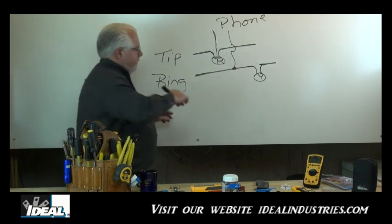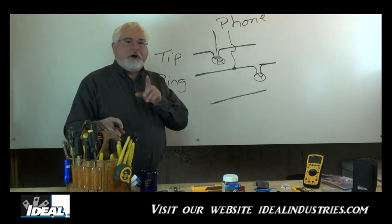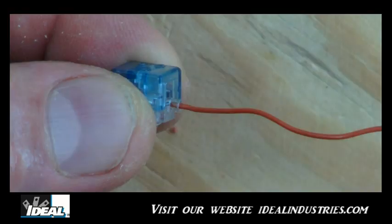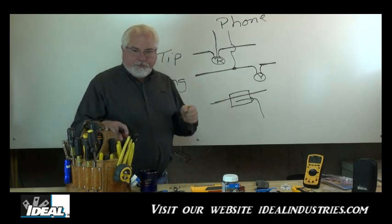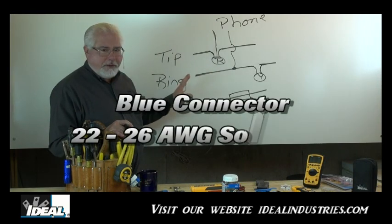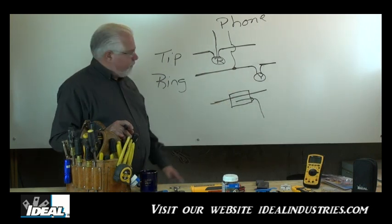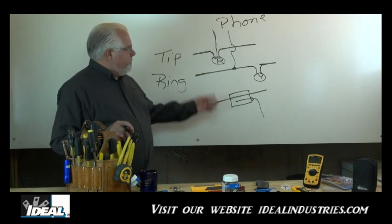Lastly, the blue ones also handle 22 to 26 gauge and are also used for tapping wires. The difference is that on the blue connectors there's a slot running all the way down one side, and the wire you want to tap is inserted into that slot. On the other side there's a small bump-out with a hole where you lay the tap wire out, and when you crimp it down it makes the connection and taps the wire. The key difference between the blue and red: the red requires cutting the conductor to tap the line, disrupting service, while the blue lets you tap a line without disrupting service because it does not cut the wire you're tapping. So if you're the FBI or CIA you might use the blues, but most sales are actually in red ones.